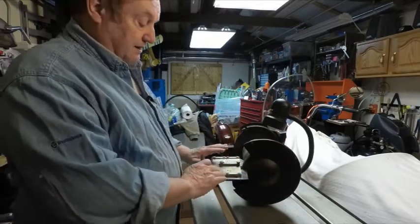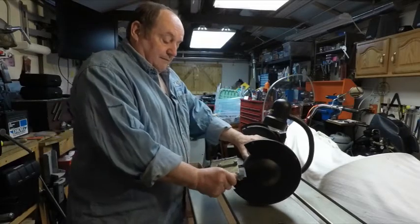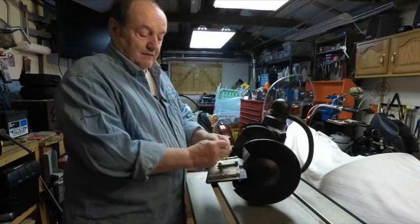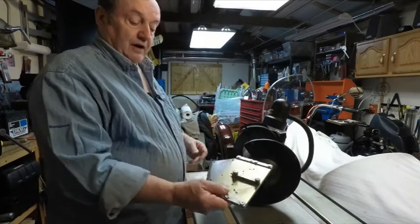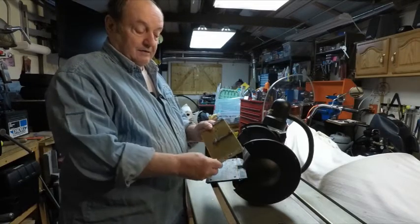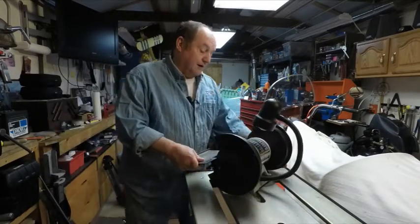The table has to be bent down — in fact it's up a little too high. It has to be bent down about nine degrees, so when you're grinding it's at an angle to make this come out right for clearance. I'm taking this little sled off because I want my next grinder to use it — I like how I can do it so fast. I'm going to take this big grinder and set it down. That thing is heavy.